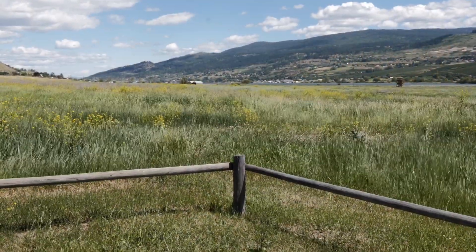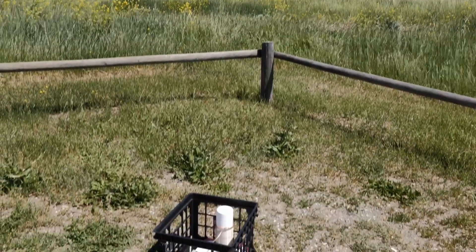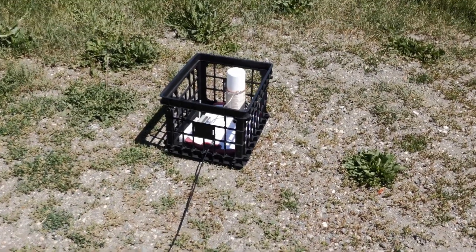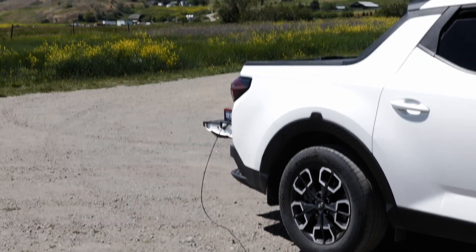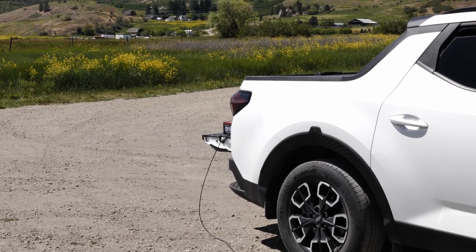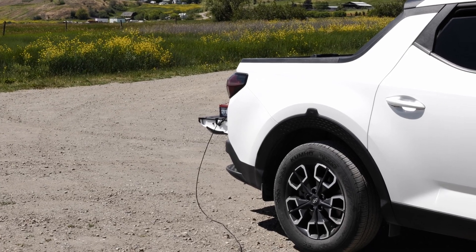Here's the setup. We're out in a nature reserve and I've got the Tesla coil antenna set up in a crate. It's connected to the transmitter at the back of the truck, and I've got plenty of ferrites on the cable to try and cut down common mode currents.